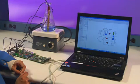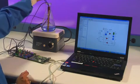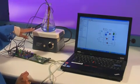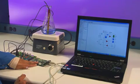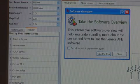Let me show you what I'm talking about. Here on the bench, we have a pH sensor solution with a pH sensor in the glass, a RTD in the glass for temperature compensation, a hot plate to vary the temperature of the pH solution, the LMP91200 evaluation board, and an SPIO4 data capture board hooked up through the USB cable to my laptop.